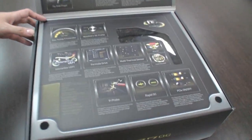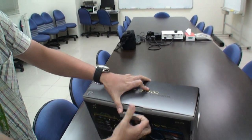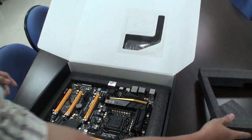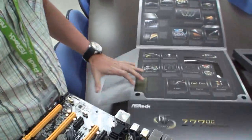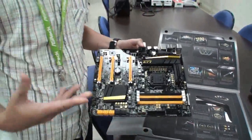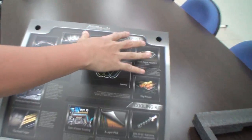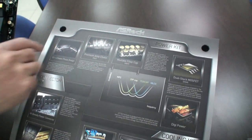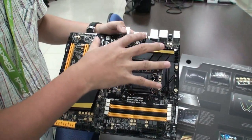Just like Chris mentioned about the features on this motherboard, you can see that we get all the benefits from the power kit — the power phase, the alloy choke, and the three kinds of caps. The benefit we get from the power kit makes the PWM from this motherboard very strong. The efficiency is up to around 97%.